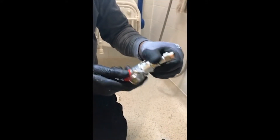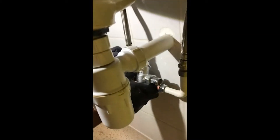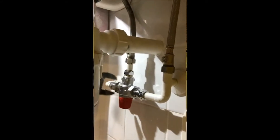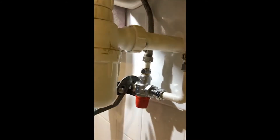The hot on the left and the cold on the right. I'm going to connect this here like this. So all we're going to do is tighten up all the loose areas of the compression joint. Make sure they're firm and tight so they have no leaks.